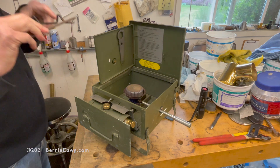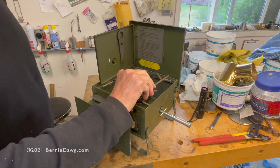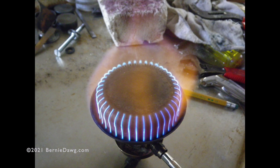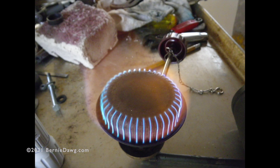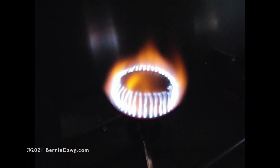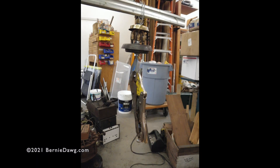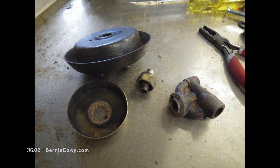As is typical of these stoves, and as I received mine, I was not very pleased with the way the burner performed when I first got it. There was a lot of yellow in the flame, couldn't really pump it up to full. No matter what you did, it just didn't really seem to want to work very well. My examination showed that there wasn't enough distance between the jet and the underside of the burner, and also that the spigot tube which goes through the center of the burner was undersized.